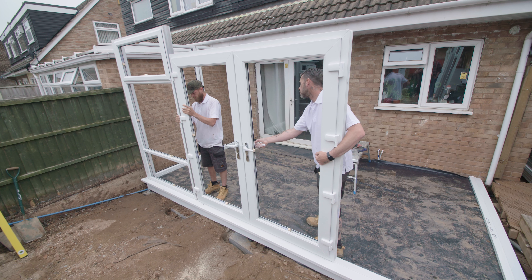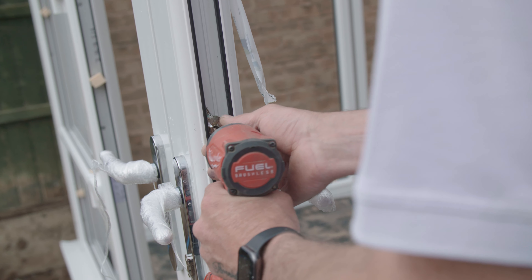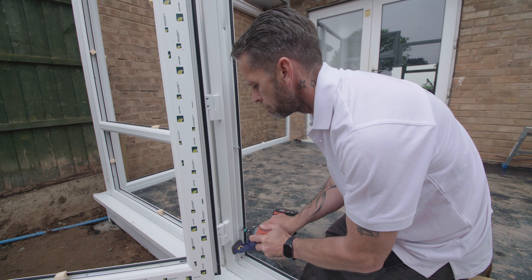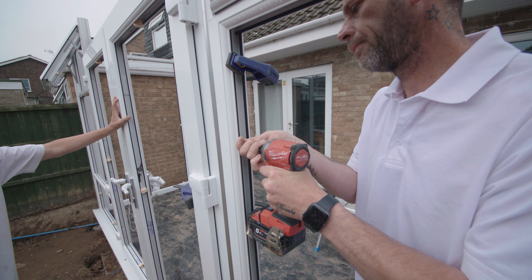When it comes to the door, place alongside the frame. Remove the keys from the sash and keep safe for later. Then secure the door to the frames with the 70 millimeter countersunk screws. The doors will need to be open for this.